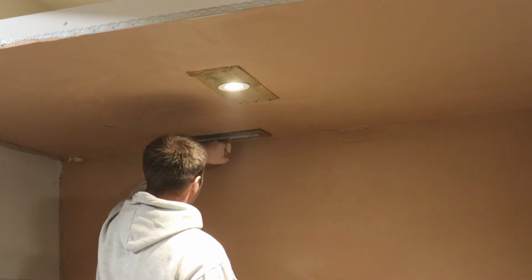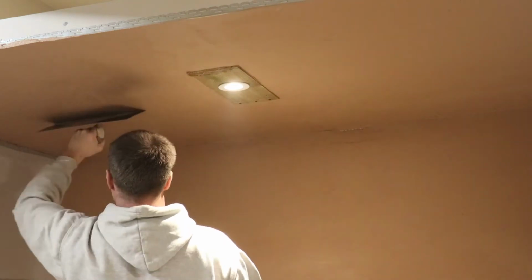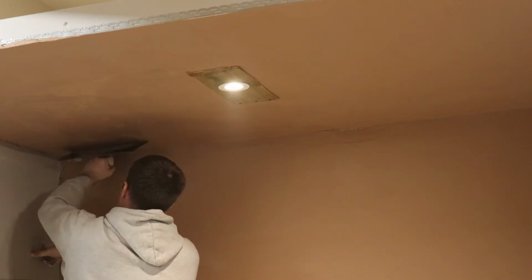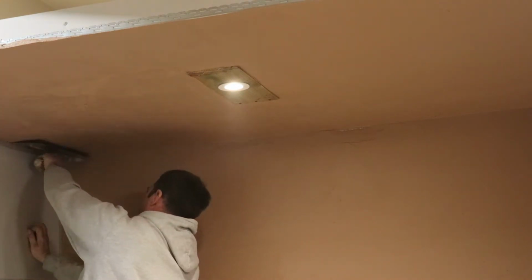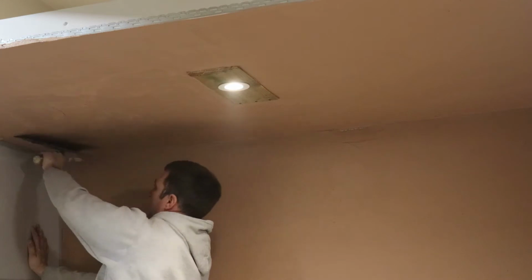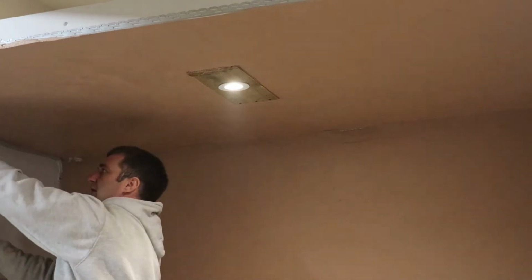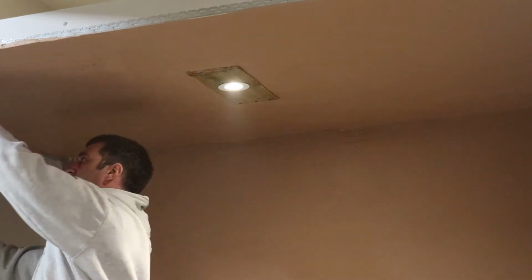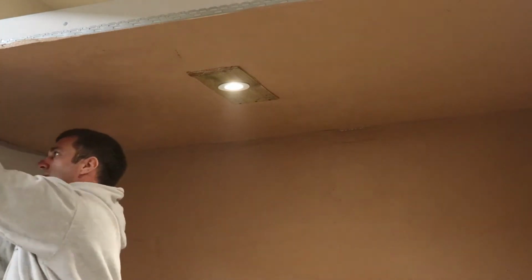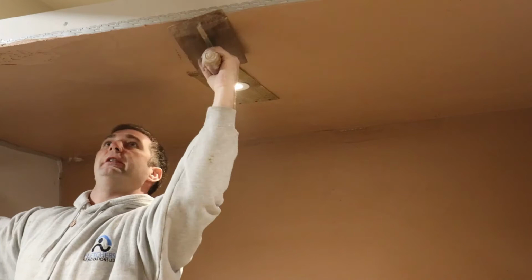And just basically bring that tram line that's on the heel side of your trowel, and just get it all smooth, but not finished. Put a little bit of pressure on. I'm still using a Marshalltown trowel, so you put a little bit of pressure on, and whatever you sweep off, you sort of put back on into the grooves, and pull back, and just make sure it's all nice and flat. And from this corner, and on the beads, just make sure there's nothing there, so the beads are all filled out, it's all been put on.